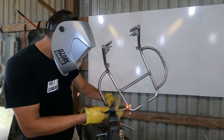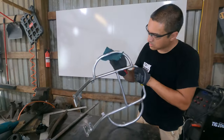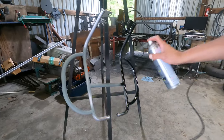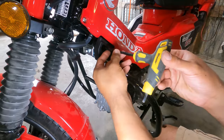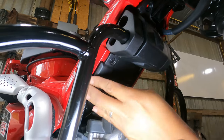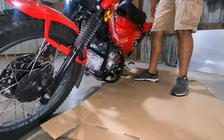After moving it up to the bench we can fully weld all the joints. After a quick scuff with the scotch brite pad we'll wipe it down with some acetone, then use some self-etching primer and then some black Rust-Oleum. So a couple hours worth of work and about $20 in materials, we've got a custom set of crash bars that add a lot of protection and awesome look to this Trail 125. Here's the finished product and I'm really happy with how they turned out. Only thing left to do is give them a test — looks like I won't have to straighten out that shifter anymore.